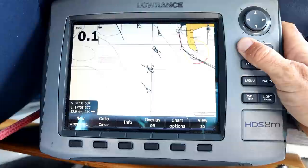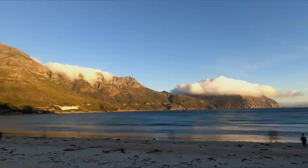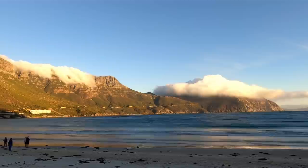That's going to make life a lot easier when we are out at sea because we'll be able to see ships coming much further off, and importantly they will be able to see us coming further off as well. After I checked it all worked last night, this morning I tidied up all the wiring behind the chart table, cable-tied everything so it's all nicely secured and strain relieved. When I checked that it still worked after fiddling with the cabling, I found I could see an AIS target - a tanker 88 miles out to sea. That's pretty phenomenal considering we were used to only seeing things maybe four or five miles, ten miles maximum. It's going to make life a lot easier and a lot safer.